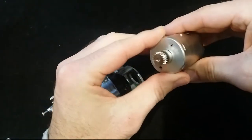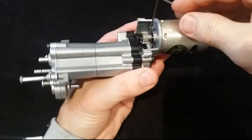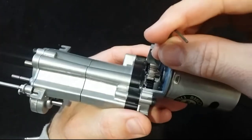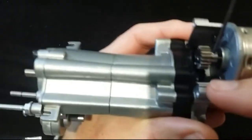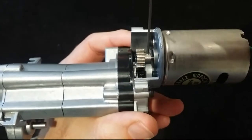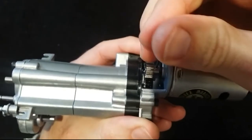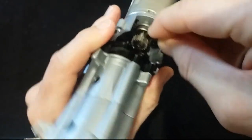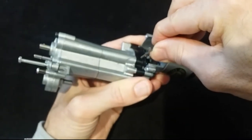I'll lock it in place and then we can move it. I've just loosened off this little grub screw and moved the gear forward so it meshes exactly in line with the main gear on the transmission. Once you're happy with it, you just lock it down. Make sure you've got Loctite on all of these - it's imperative because they will work loose if you don't, and you'll have a stripped gear and you're not going to be happy.